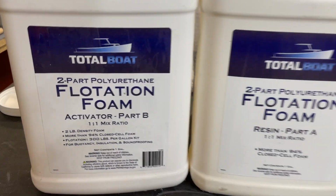Our watertight battery and engine compartments will both keep those systems dry and provide flotation in the event of a wave breaking into the cockpit. We plan to fill the sponsons with 2-part expanding foam to make the boat unsinkable and at the same time add more rigidity to those planing surfaces.